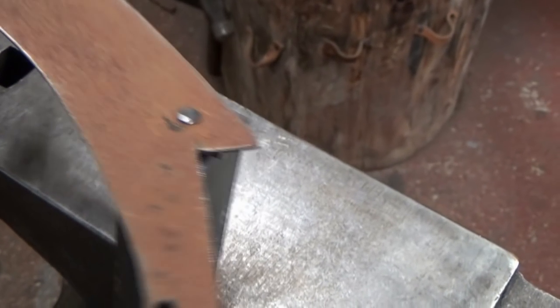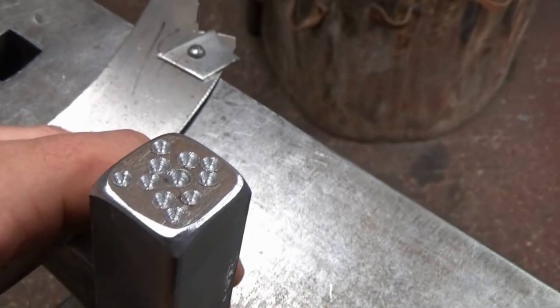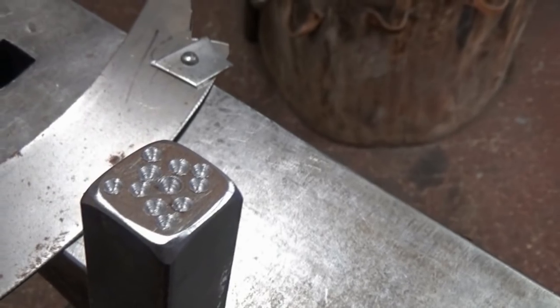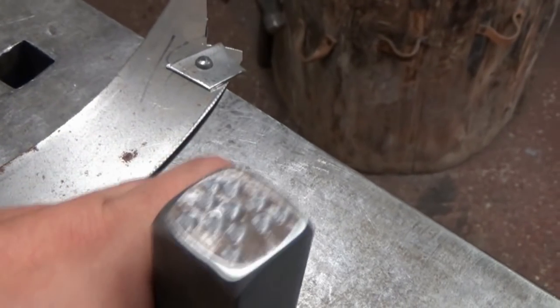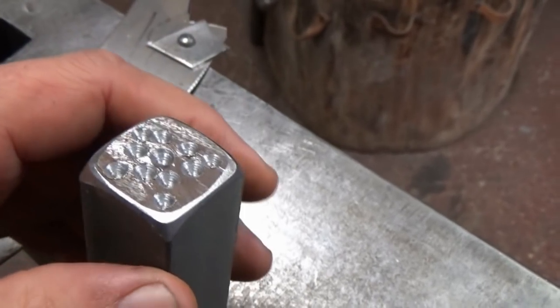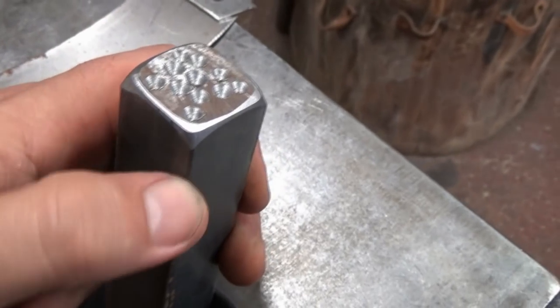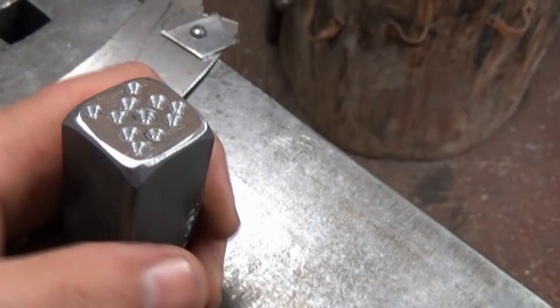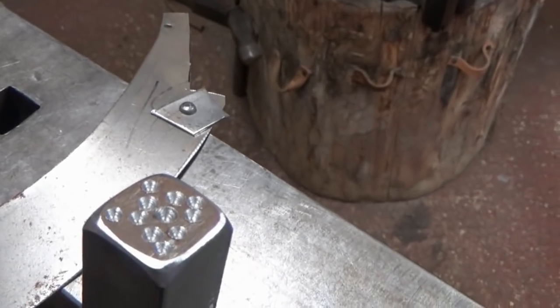I've not even dressed the holes off — they'll dress off as you offer the rivets up and all the burring will disappear. By putting the same size hole in the top, you can pretty much just offer up a bit of work and it will find a hole. This is the wrong size rivet for these holes, but it will just find a hole and you tap away, and over time that will work itself down to be smooth. It's best to use mild steel because it will deform slowly and ease off on the sharp edges. You can make it more dome-like in profile if you like, and then it will just sit inside the hole on your anvil, in your vice, or whatever you have.